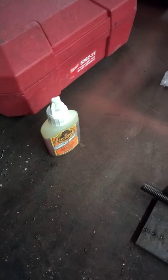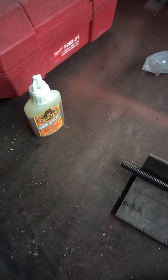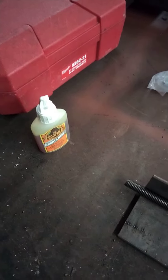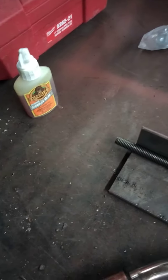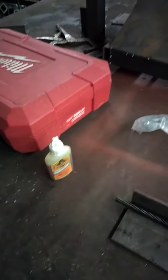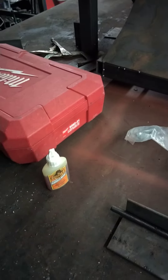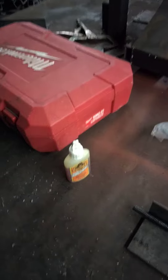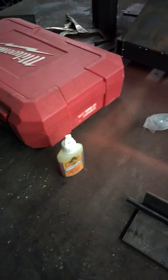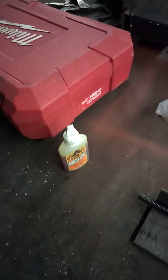If you're doing something structural with an engineer, they've got special stuff that you have to use. I've gotten several handrail jobs just because of that right there - people ask me how I was going to do it and I tell them I'll drill and glue all the bolts in, keep the water out so they last longer. I've got concrete bolts that are 30, 35 years old, still haven't came loose - holes full of Gorilla Glue. Just something a little extra that I always do.